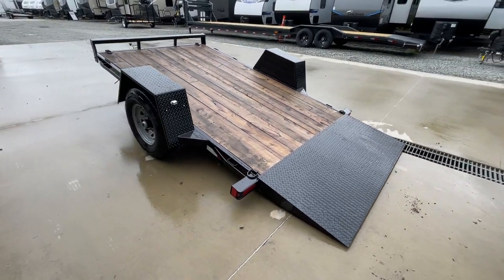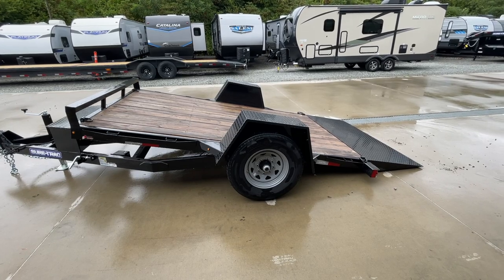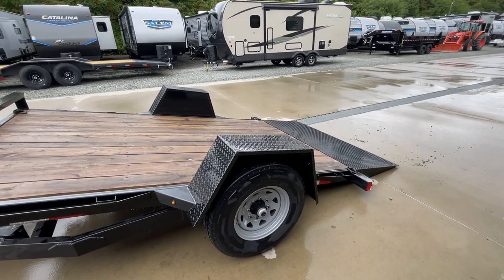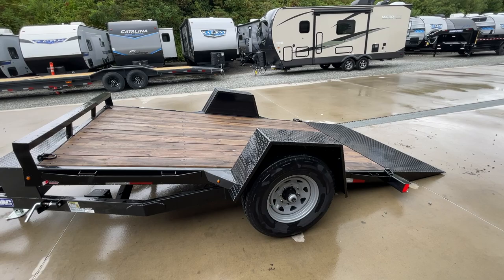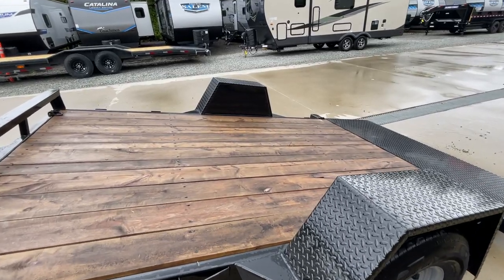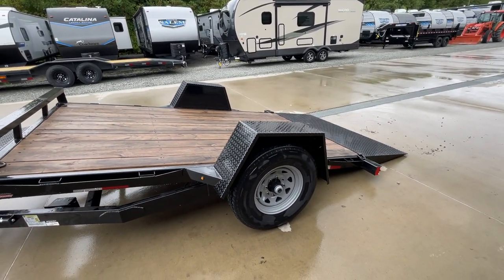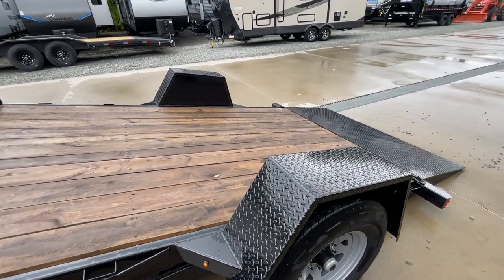While talking about tilts and angles, this unit is going to get about an 11-degree angle — low enough that you can load most smaller pieces of equipment: walk-behind trenchers, Bobcats, and the like. The single most common piece of equipment on this would be a scissor lift. I also get guys that do UTVs, compact tractors, and all kinds of other uses. You may have noticed it's got a taller fender — that's because this unit uses the torsion equivalent of a drop axle, which gets you down lower to the ground and gives you that nice low angle, but obviously if the deck moves down, you end up with a taller fender. In an application like this where you're not opening a car door, there shouldn't be any adverse effect to having that taller fender.